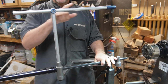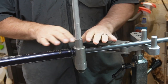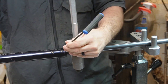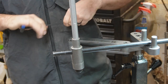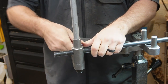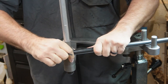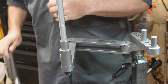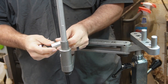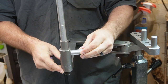This is the laser setup, which is optional, but I opted for it. Now I'm going to show how to swap out this tool — I'm going to remove the handle. I'll loosen the one set screw and slide out this three-quarter inch bar. We're going to replace it with a half inch bar, so I'm going to need this half inch adapter. It has a hole in it for the set screw, so I'm going to have to line that up to the set screw on my side.